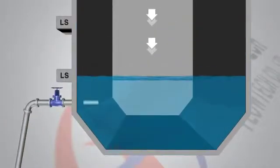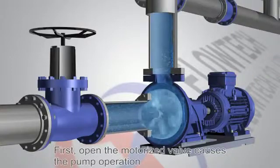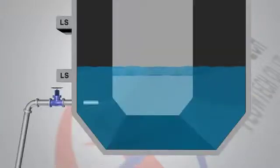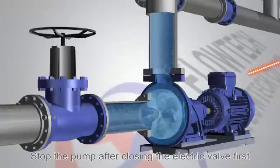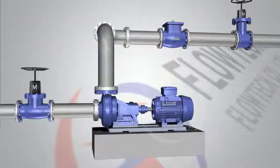Generally, pump operation starts by opening the motor-operated valve when the tank's water level is low, then sending a signal to the pump when the valve is sufficiently opened. When the water sent by the pump fills up the tank to make the water level high, a signal is sent to close the motor-operated valve and then stop the pump. The purpose of doing this is to minimize the change of flow velocity.